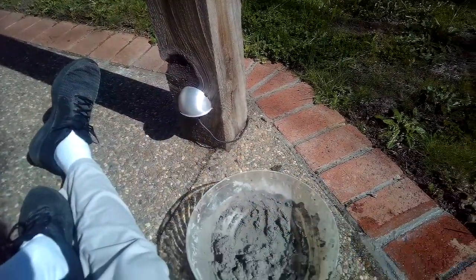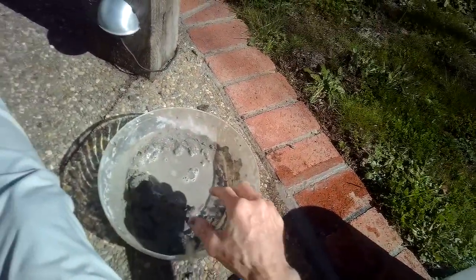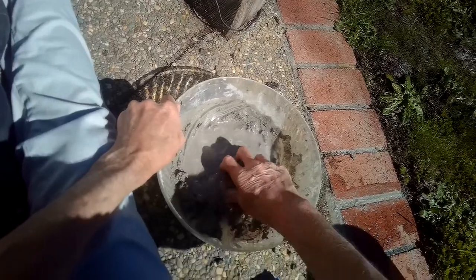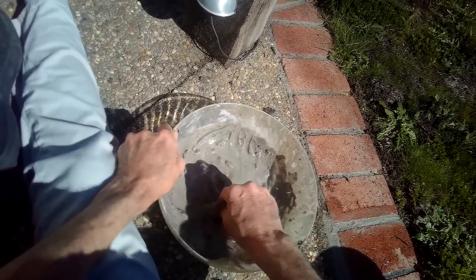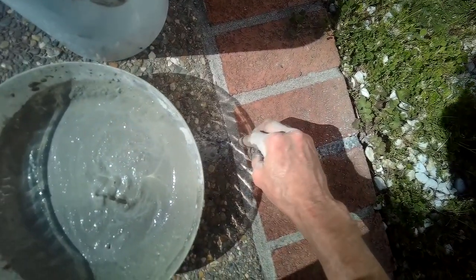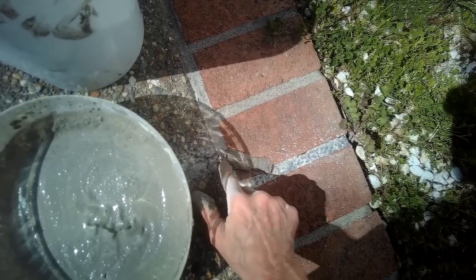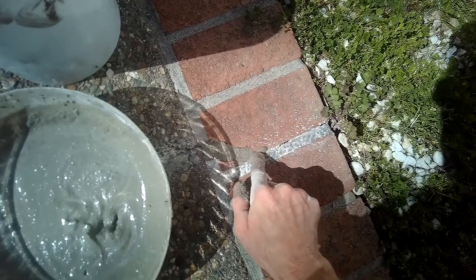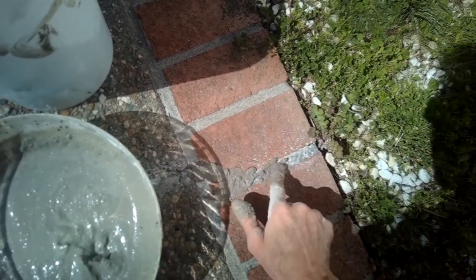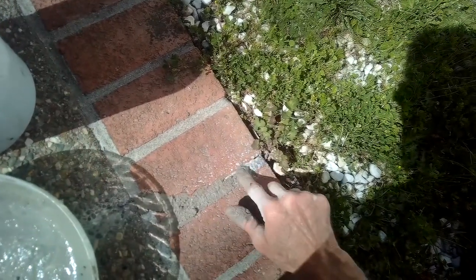We're going to go ahead and actually cover the area that was done previously with the wrong material so it looks a little better. My material is getting a little bit dry, so I'll add some water, mix that in, and get it workable again. I've got a crack in the brick too — I'm going to use this really watery mix to get into that crack, then wipe it all off with a sponge. I don't want any cracks, and even that little hole there — I want to pack that in. I'm also covering up the previously-done material because it's not a good color match or consistency match.